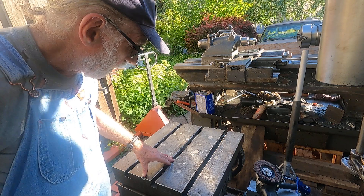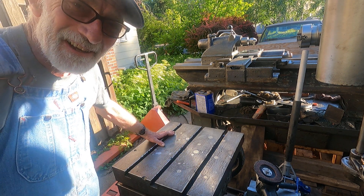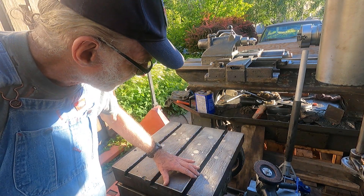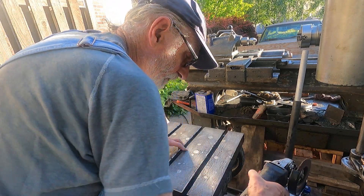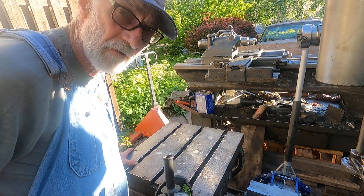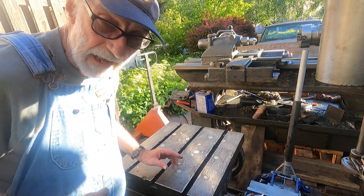You can see it's been repaired — all of these drill holes were nickel-welded in, and the table was resurfaced. They resurfaced it down enough that it made the edges sharp. So I took this brace and did the best I could to break these edges all the way around, because the drill marks where they kind of missed the slot are sharp.